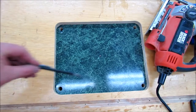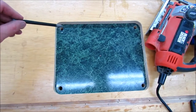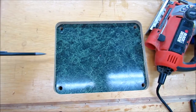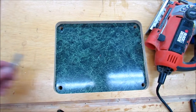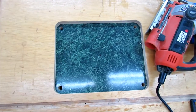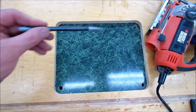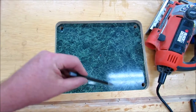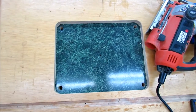When you want to cut out a space like this, I think that cutting close to the final size is a good idea and then using a router bit like this pattern cutter to smooth it all to the finish size. I'm going to use a jigsaw and just connect these holes all the way around and use the router to finish it up.